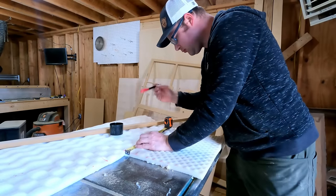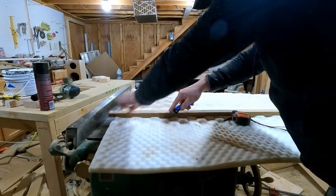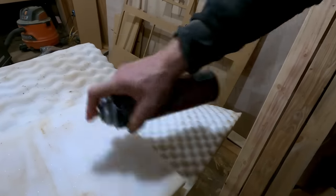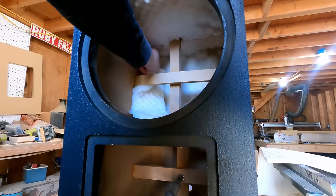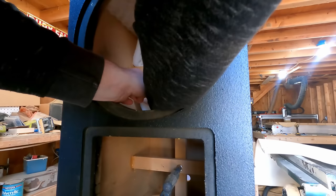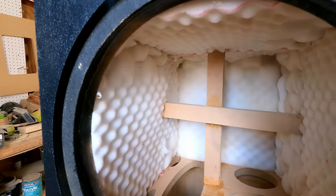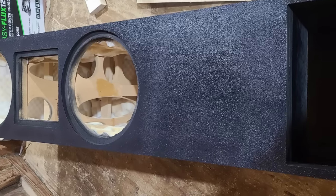Now that everything is painted, the last thing I'm going to do for sound quality is add dampening material into the enclosure. You can use all kinds of dampening material — I just used an old mattress pad, but use whatever you're most comfortable with. I cut the mattress pad to size and sprayed it with 3M 77 adhesive glue. The biggest challenge is going around those internal braces — you may have to cut some reliefs in the mattress pad to get it in there. I used a queen-size pad and it worked for both speakers, though a king size would have been nicer. I lined the entire interior except anywhere near the port.